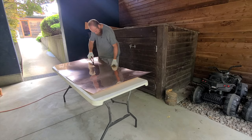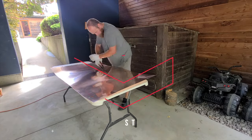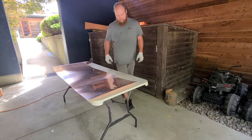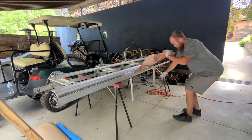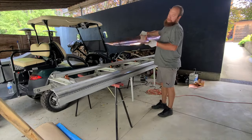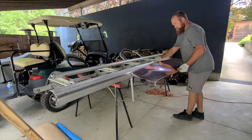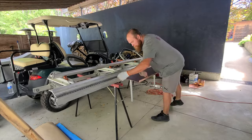Here I'm just using a pair of pelicans to cut it off. If you're interested in any of the tools that I use, I'll put a downloadable tool list in the description of everything that I own and some essential must-haves for performing these kinds of details. Here I'm just creating the seam on one side, crushing it over with the portable brake — using the bending leaf to crush, as any of you portable brake guys know out there. And finally I'm going to line it up to put my 90-degree wall flange bend in.